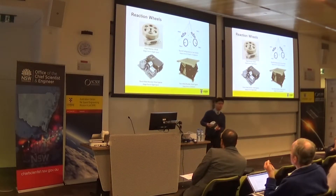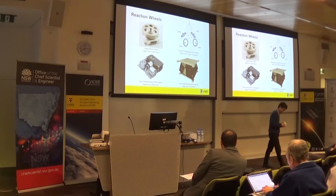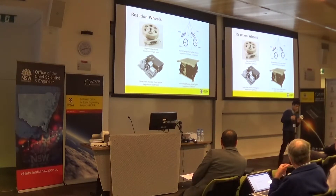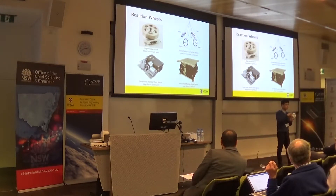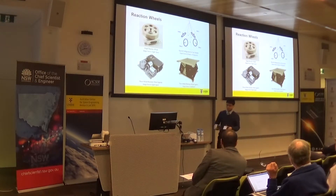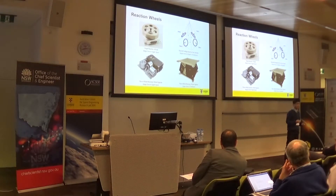For those who haven't heard about reaction wheels, they're basically metal discs attached to motors. The principle of operation is: if you're in space and you start rotating a wheel clockwise, then because of the conservation of angular momentum, your satellite will start to rotate anti-clockwise. So if you have a wheel in your X, Y, and Z directions, you now have full three-axis control of your satellite's orientation — and we call this a reaction wheel system. Most satellite manufacturers also add a fourth reaction wheel for redundancy, so if any one unit fails, the other three can still provide three-axis control.